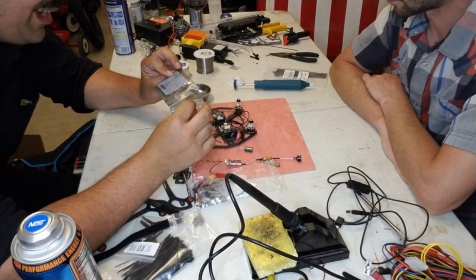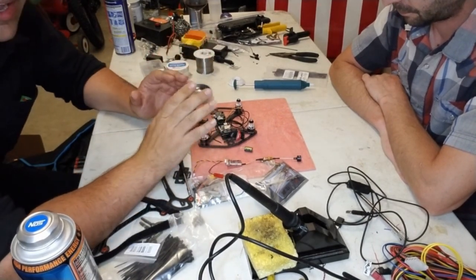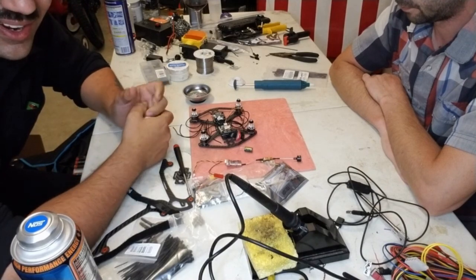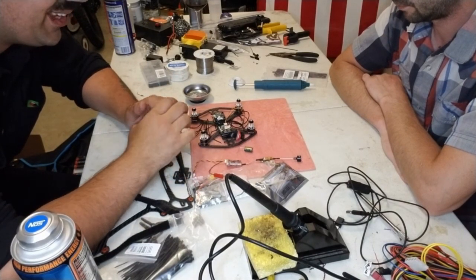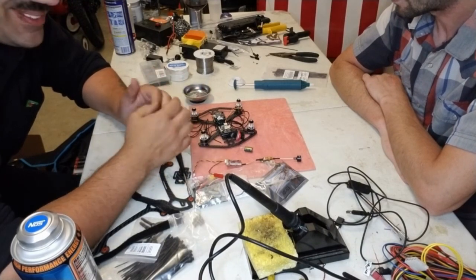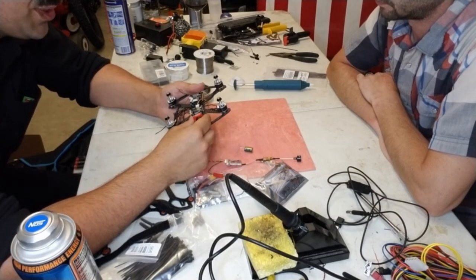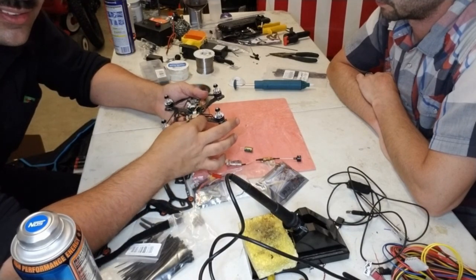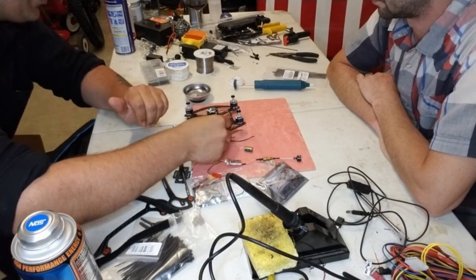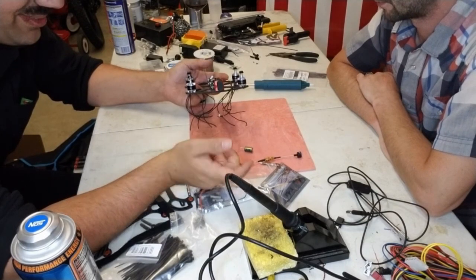They're using their new AFHDS3 protocol, so that should be pretty sweet. To be honest, I'm not sure all of these parts are the definitive choices — I did a lot of research on three-inch builds and it's all relatively inconclusive. This frame was made for having a two-part camera away from the rest of your stack, so hopefully we're using that correctly. We'll be running 4S 850 milliamp-hour batteries.